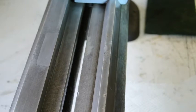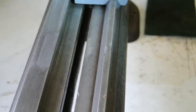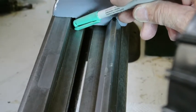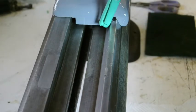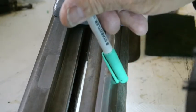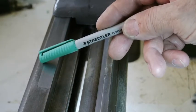Right, I've cleaned off the glue from the little plate that I let in and glued in, and that's turned out really very well — I'm pleased with that. I've put the tailstock in just so you can see how much of the tailstock bears on which surfaces. You can see here there's a gap between this surface and this surface, so the whole of the tailstock is bearing just on that flat surface and on that V and on that V — and not on the top of the V either. So the fact that there are some burrs and things along here — provided there's nothing on that angle or on that angle — there won't be any problem with them affecting accuracy.